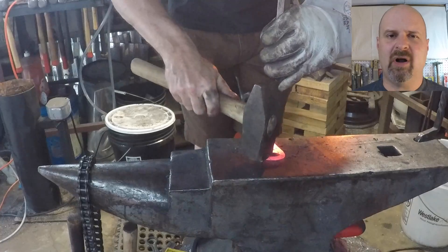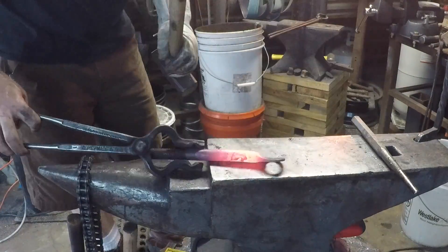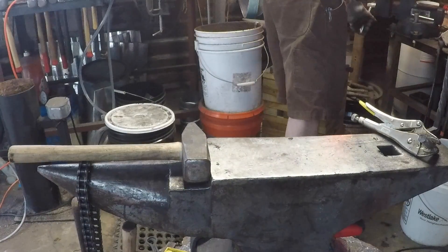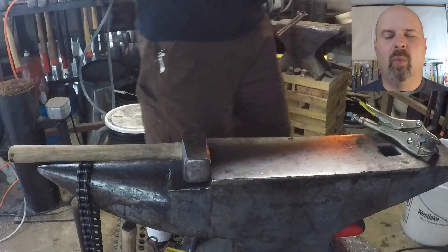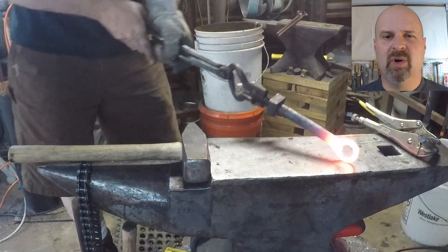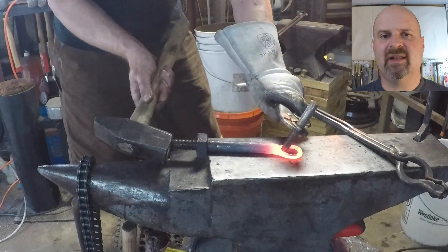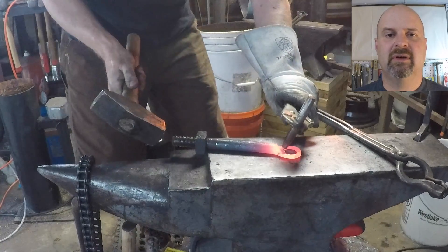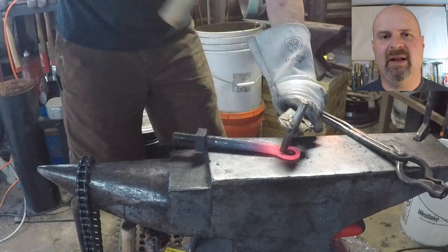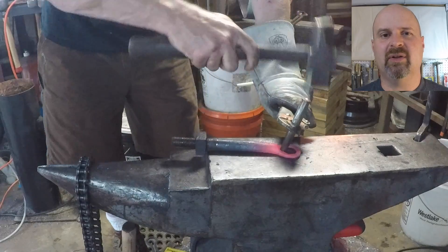You can adjust a little bit — if you get that mark off, just reset it a little bit over the edge of your previous mark and you can get it in the right place. Once I have the mark with the small punch really set well and I know it's right in the center, I go to a little bit larger ball-nosed punch. I like how it looks when it comes out — I like the little round nose. That's the five-pound hammer still. I'm going to work it for a little bit and then come back with a lighter hammer and planish it to smooth it out so there aren't individual hammer marks. Just makes it look a little cleaner, a little bit nicer.